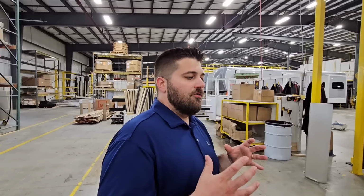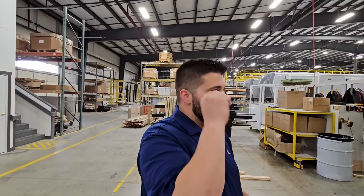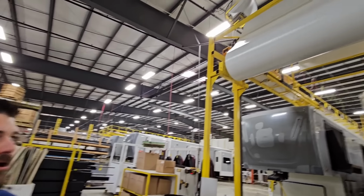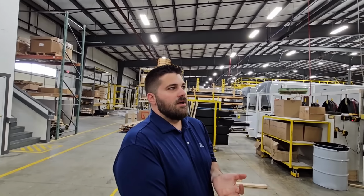When you look at a lot of fiberglass walls for RVs, they're made off a fiberglass roll like this. They unroll them and they laminate it. So what we're doing is 3/8 plywood decking, and then we're taking this fiberglass and gluing it to that plywood decking. It's going to be a stronger product. It's easier for repairability. And you get some better paint adhesion to it as well. It's thicker, too. It's a lot thicker than your traditional... It is a lot thicker.